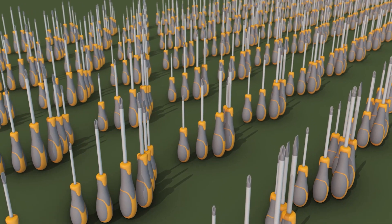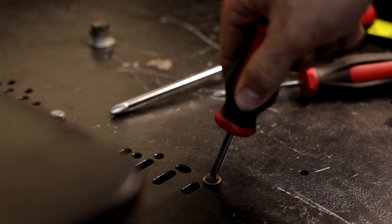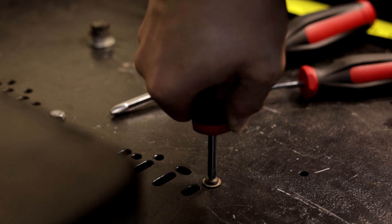Here we have the Phillips head screw. For some reason manufacturers still use it today — and definitely through the 90s and early 2000s it was used for machine screws that are too tight to be a Phillips head. If you encounter one that's too tight and risks camming out, be gentle, apply a lot of downward force, and you might be able to loosen it with a little tapping from a hammer. A little penetrating oil never hurts either.